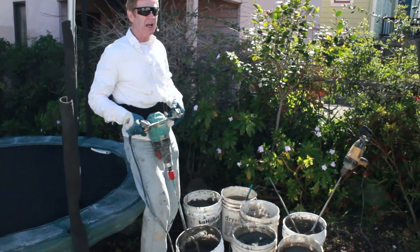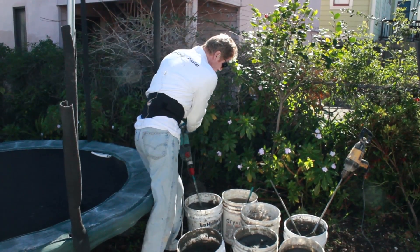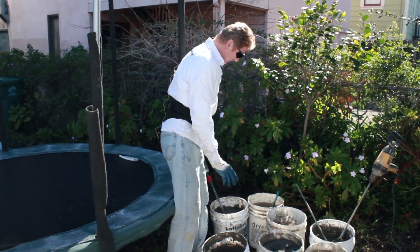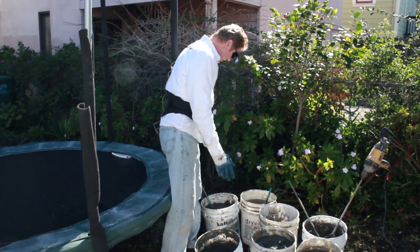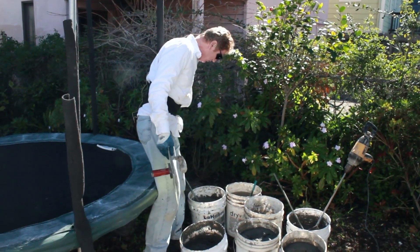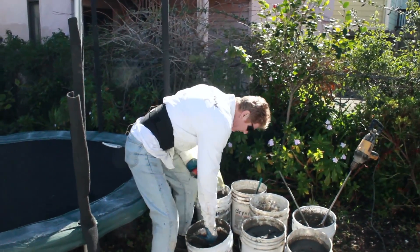Here's real important: never stick a dry blade into a mix — it won't work, it'll stick to the blade. What I do is put it in water first, and I use a full bucket of water. If the bucket is half empty, you'll tilt the drill and the bucket will fall over. And if it falls over while the drill is plugged in, the water hits the drill — don't do that, guys. Not good.